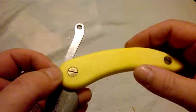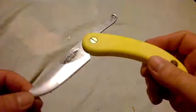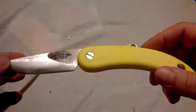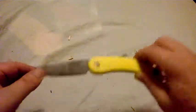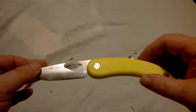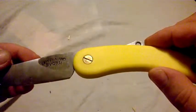What we really need to get is a proper screwdriver. Gunsmith turn screws are absolutely brilliant, and I bought a set at a car boot sale recently, last year, for not very much money. They're sort of old-fashioned ones, where the tip of the screwdriver comes in sort of like this, not one of those ugly, terrible things. But I suppose that's what a peasant would use, wouldn't it, really? A craftsman would use a proper, I can't remember what they're called, concave grind, which you're going to need to do if you're going to adjust this screw.